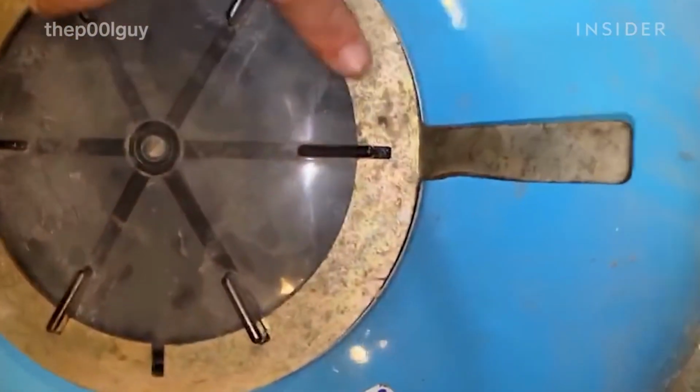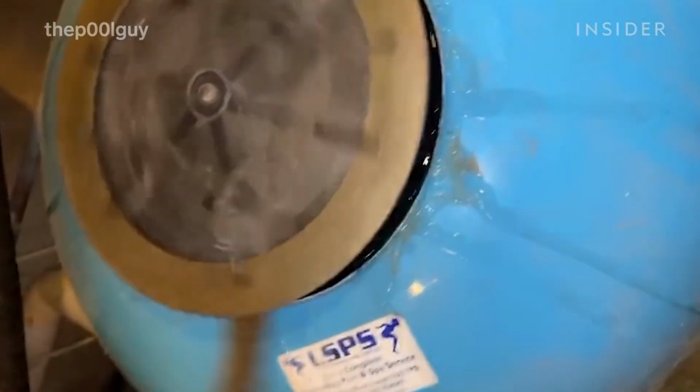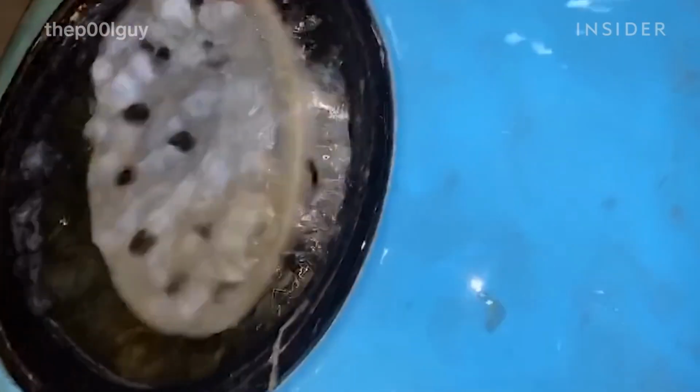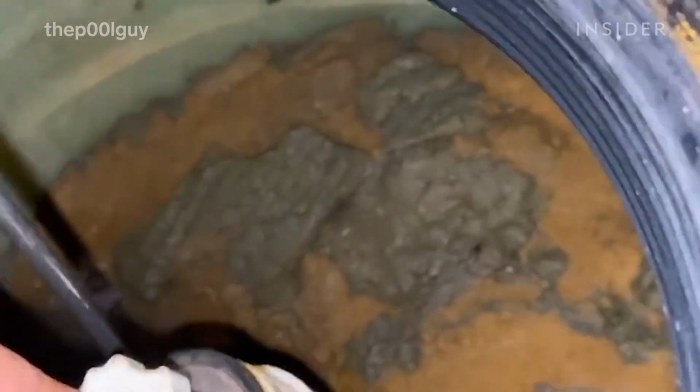The dirtiest parts of the pool are going to be the filters. Basically, the water runs through the filters continuously or on a timer. The blue tank is the filter with sand in, and that keeps the pool water clean. It catches all the dirt and the stuff that's floating around in the pool. Once a week, or once every 2 weeks, whenever I do maintenance, you do a backwash, and that gets rid of all the dirt and anything that's been floating around in the pool.